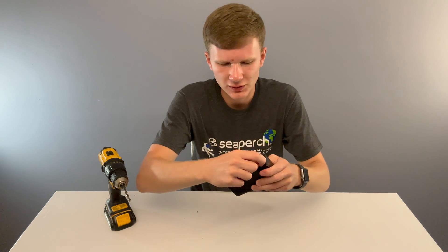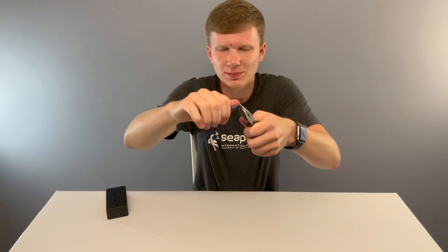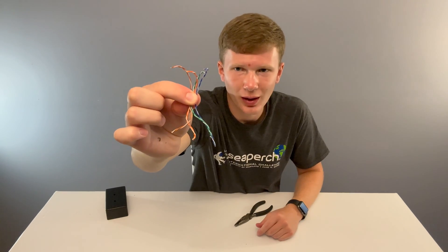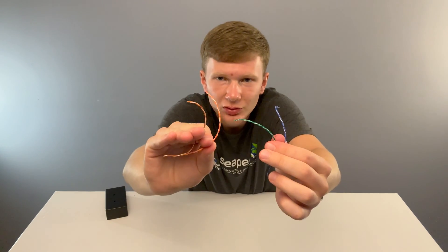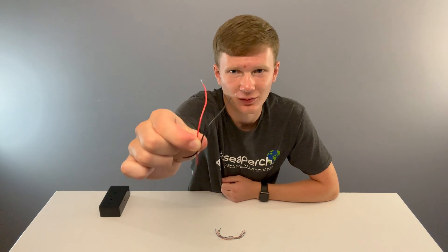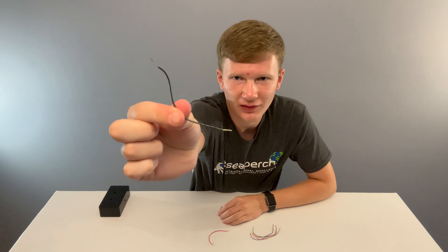Once you've drilled all your holes, peel off your tape. Now get your Cat5 wire and peel off the outer casing. You may need the help of some tools to get started, but once you get the wires out, you can just pull on them and the casing will come right off. You now have all your pairs of wire — yours should be a bit longer than mine. You should have blue, green, orange, and brown. The solid wires are positive and the stripes are negative. I'm going to refer to these as the colored wires. Also, cut your two feet of black and red 22 gauge wire into four equal length 6-inch segments — I will refer to these as the red positive and the black negative wires. Go ahead and strip between a quarter and half an inch of insulation off of all the ends of all the wires.